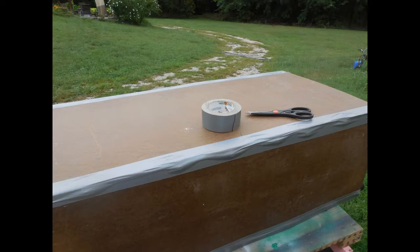Now you want to cover the screw heads and the gaps between the panels. Use duct tape or similar material over the seams to close any gap between the front and the side panels. You can use scissors to cut the tape smoothly. If you want a neater appearance, you can cover the seams with quarter-inch or half-inch styrofoam secured with glue, though this will add some cost. There will be a small gap of about one half inch between the inside of the front panel and the shelves. To make the prop more solid, place a half-inch piece of scrap wood in that space and secure it with a two-inch screw driven from the front panel through the wood spacer and into the plastic shelf.